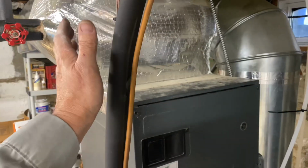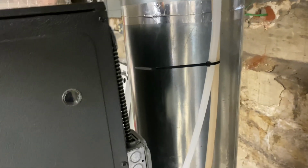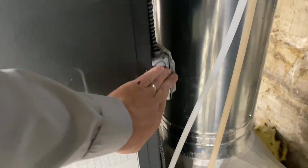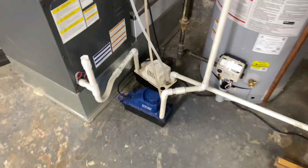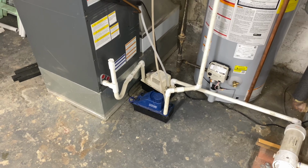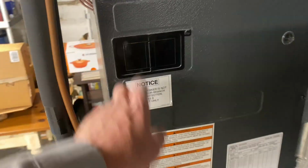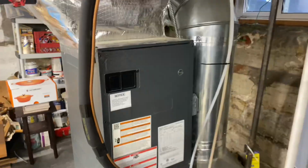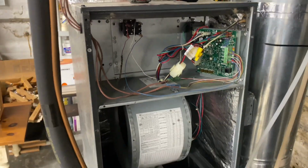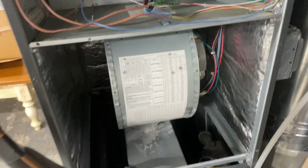We want to find the electrical compartment, and generally if you follow the voltage or the power wires coming in, this is low voltage. This is going to be our line voltage going to a breaker, a switch, an outlet for condensate removal. Looking pretty interesting here, actually. Dual condensate pump removals. We're going to pop out these 5/16 screws and then expose the electrical connections.